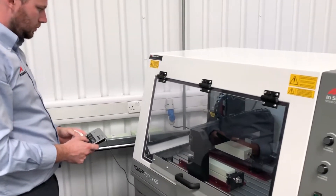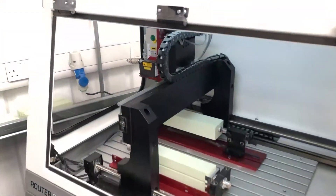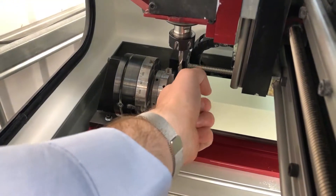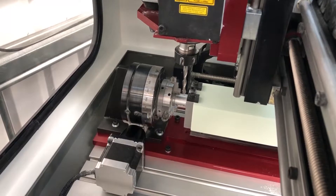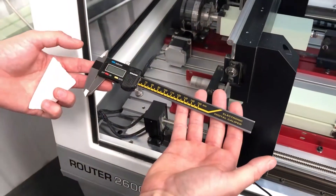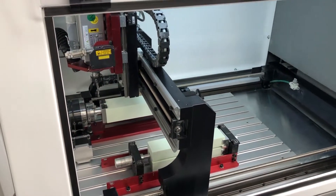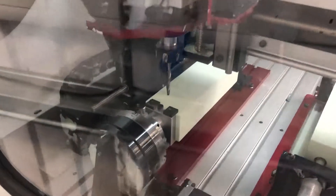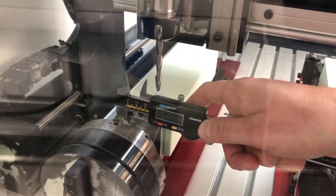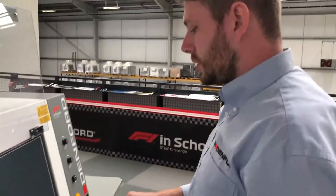It's rapid — we'll move the tool across to the other side. When you are somewhere near you can open the door for safety. We bring the tool down at the side of the billet to touch on this side. We lift the tool up to give more space to use the verniers to measure, and once measured we need to read and remember that vernier value for when we come to set the fixture later on.